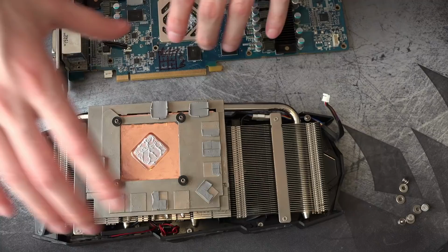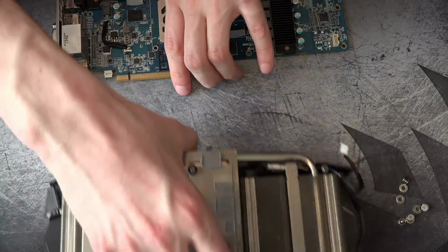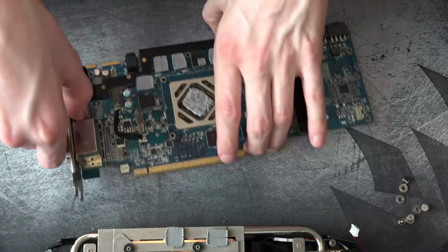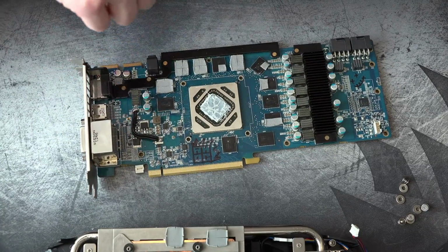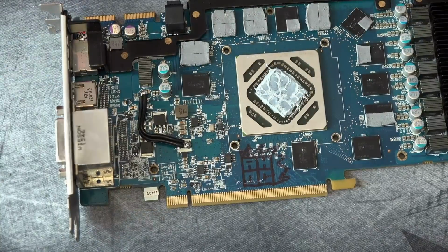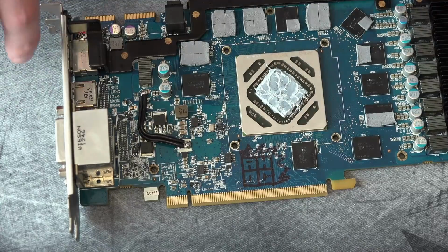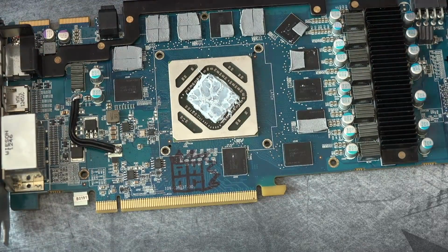So, as you can see, this thing doesn't leave a lot of space in that area. So I ended up getting rid of the red bodge wire and replacing it with these two black ones. These are two black 18 gauge wires, and there's two of them in parallel for more current capability. And yeah, it works out quite well. I think it works out nicely. It looks a lot less terrible than the red one.